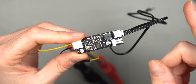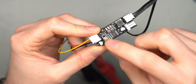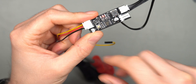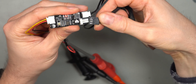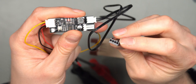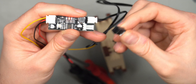To summarize: single press increases fan speed, double press decreases it, long press enters programming mode where the first step is the high temperature, another long press sets the lower temperature, and the fan will ramp according to the interval between the two, running at 100% at the highest temperature. However, when I try to connect a PWM fan, the first issue is that the PWM fan's fourth pin has no room to connect on this PCB.